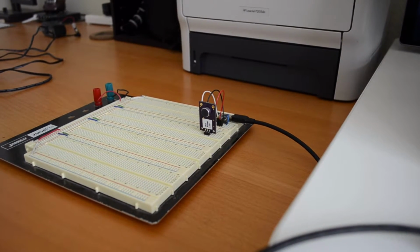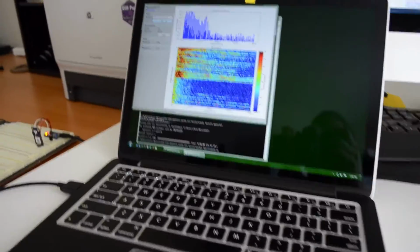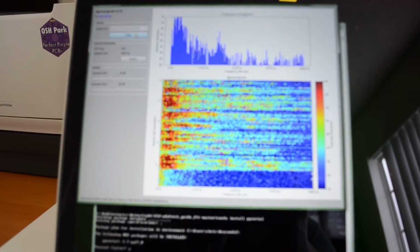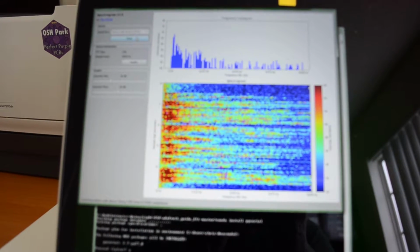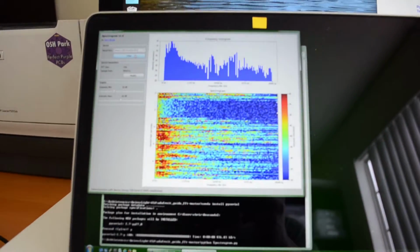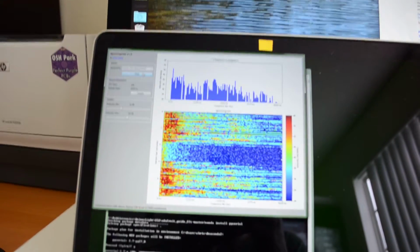So this is the Teensy LC still running the Adafruit spectrum program, and now it's outputting to my laptop, which is running on battery power, so there shouldn't be any AC mains hum, and still getting quite a bit of noise. Maybe quiet for a minute. So I'm going to assume it's picking up ambient noise. I've got one more place I can try this, the downstairs bathroom that's disconnected from everything, so going to go try that.